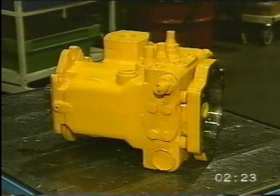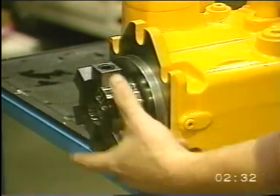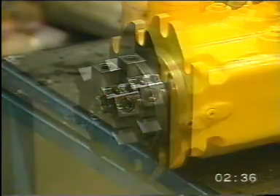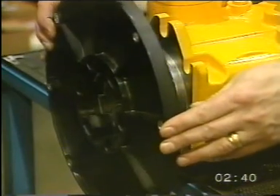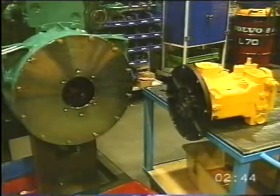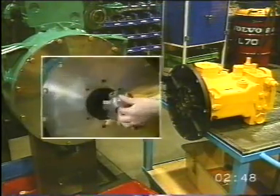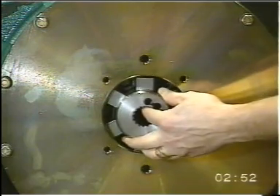The hydrostatic system oil cooler to the left also serves all other hydraulics. Here we see a hydrostatic pump of later design which has no cover on the side. The drive segment for the hydrostatic pump against the diesel engine is secured to the drive shaft with lock screws. The flexible disk transfers power between the diesel engine and the hydrostatic pump and is fitted to the diesel engine flywheel. Here we show the attachment of the drive segment against the flexible disk.